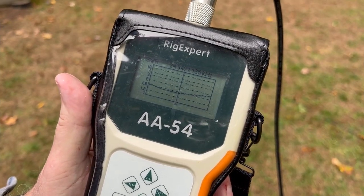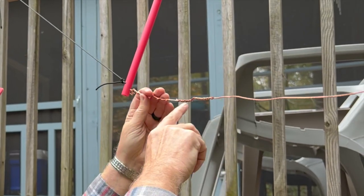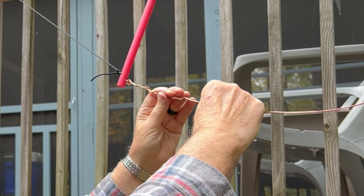We've got it resonant in the 12-meter band now. Let me walk you through what I had to do to fix this. The issue was that even though I added an extra six inches to each leg, it wasn't enough — I needed a little more to make the antenna resonant. How do you make a wire longer? And you can't just reassemble it because the far end is already in the tree with the antenna rope, and redoing that would be a real hassle. There is another way — this is known as the Western Union splice, or the lineman splice. You take an extra piece of wire and do this double twist. The splice is here, but you twist the wires over each end, and now you've got a splice that's going to hold. I'm going to throw some solder on that just to hold it together, and I think this antenna is ready to go up.